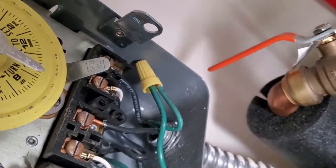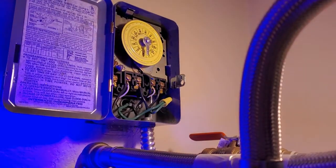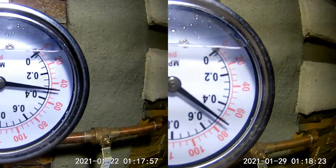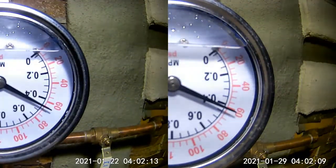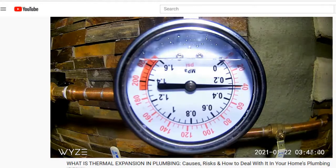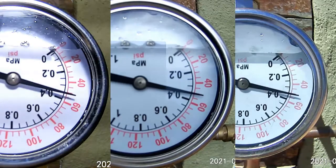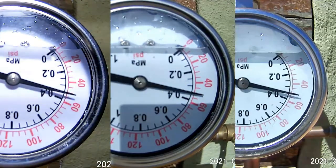Second, if you choose to leave your water heater on, this will have a huge impact on your results during longer tests. You need to turn the water heater off and cool down the water in a tank water heater for reliable results. During the first couple of baseline overnight tests, I ran them with the water heater still online. You can see there were spikes in pressure from thermal expansion. No one is using hot water at one or four in the morning — the water heater kicked on to maintain temperature. While I say spike because we're looking at eight hours over the course of a few seconds in a time lapse, in reality the heat cycle lasted five minutes, increasing the pressure between 20 to 30 PSI. Thermal expansion makes a longer test harder, if not impossible, to get an accurate reading at the end.